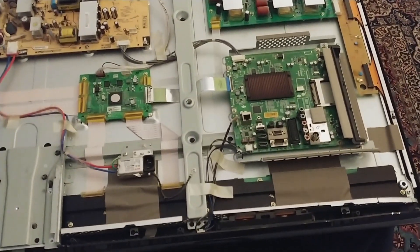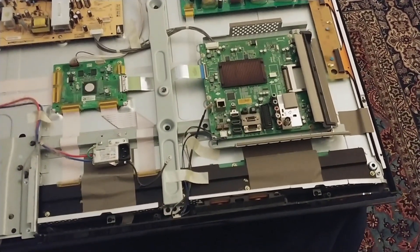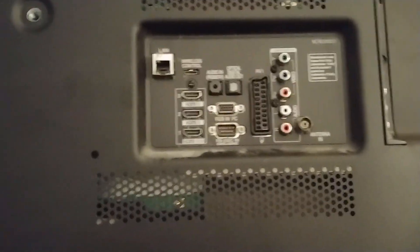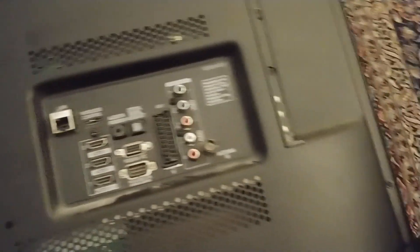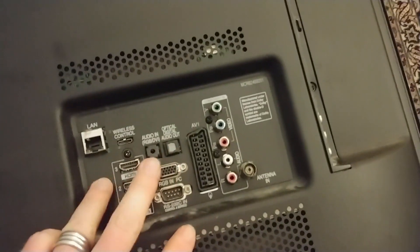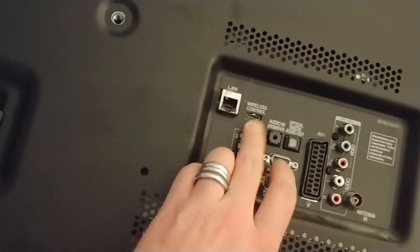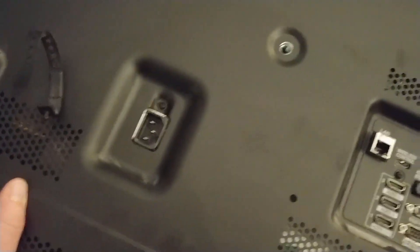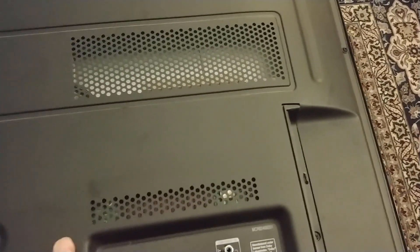If it doesn't work, we can try baking it again at a slightly higher temperature, but in all reality I probably wouldn't do that. I've now reassembled it and put the back back on. It's worth noting the longer screws along the edges and some of the shorter ones that go over the main socket area are different lengths. If you are taking it apart, put them in separate pots or remember which ones have got the slightly unusual length so you can put it back together properly. The case is all now back together, nice and closed, ready to go back on the wall.